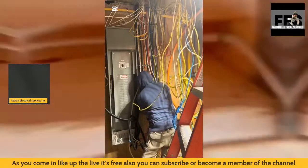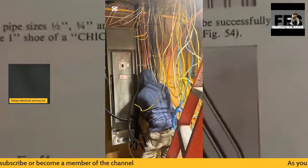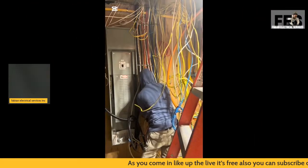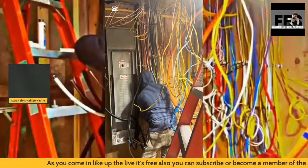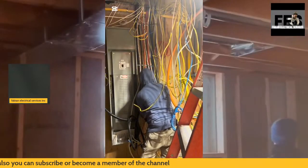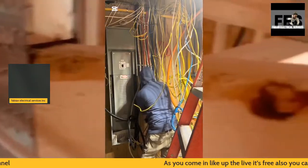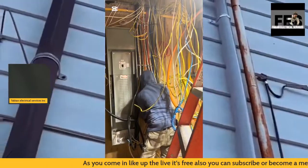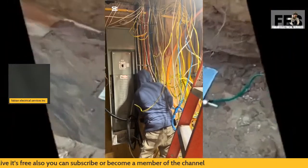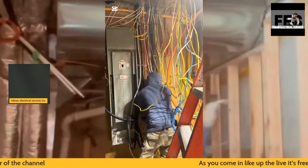And also you can see, this is a 400 amp panel people would see on a daily basis. You can actually use this in commercial also. This is a single phase. I'm not sure that the actual breaker can be changed as far as three phase. There's no way you can change it, because you obviously will have some configuration inside of the panel.